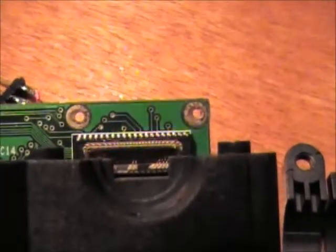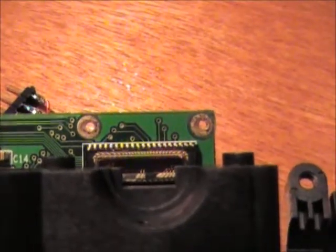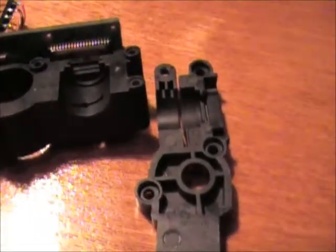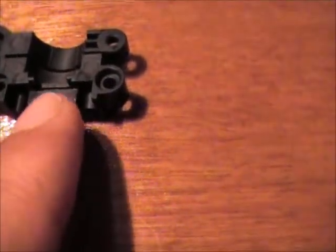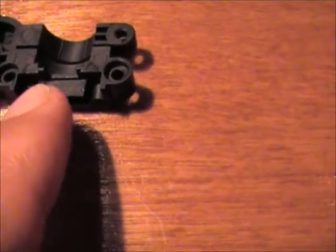You'll see here the sensor's active area is only on the right-hand side the way we're looking at this. The whole width of that sensor isn't the active area, so they have it offset behind here so that the lens and everything aligns up with that little area. The board is screwed on to the back of this housing right now so we can see where everything sits. Looking at the top, you can see a little shield of some kind that goes right down on top of the sensor, trying to basically contain everything to this little area. This thing is an exacting fit to that sensor to help center everything.